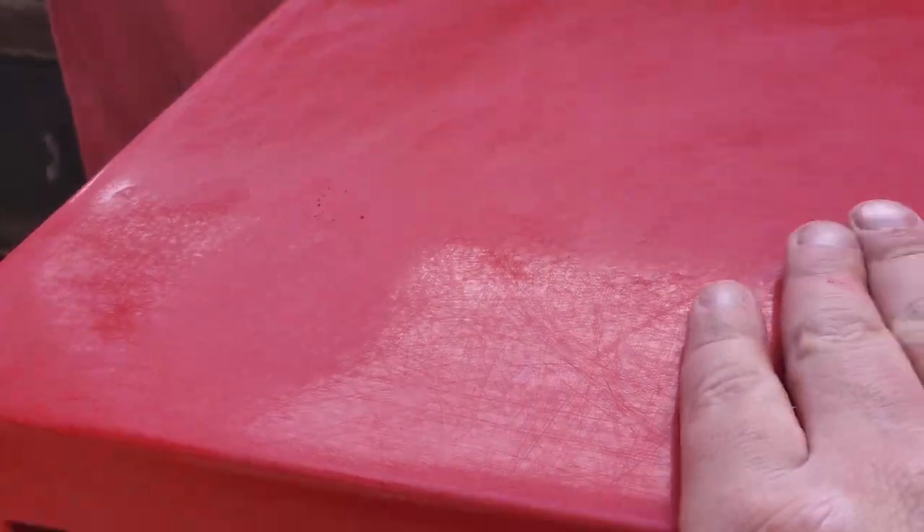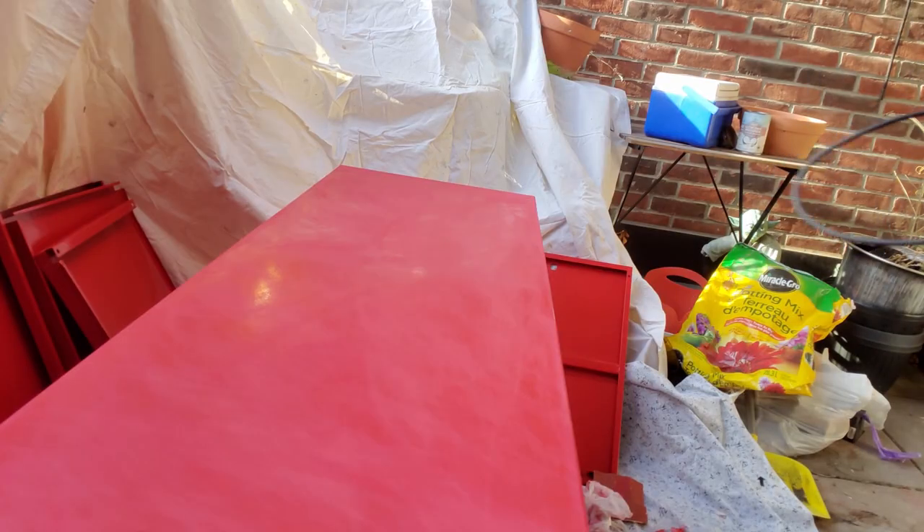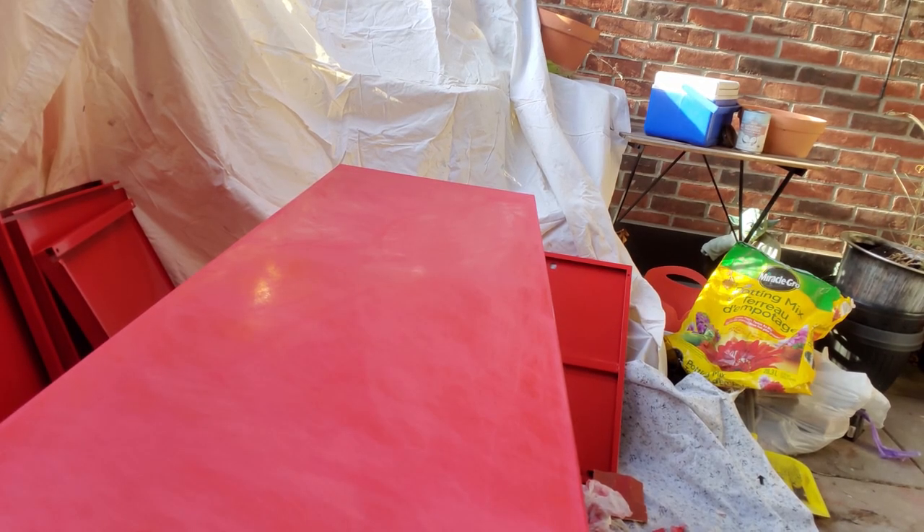You can see the big difference — everything here has only been done once, but this has been done twice with the 180 grit, so it's quite a bit smoother. I'm just gonna wipe everything down with a wet cloth to get all that dust up and then go over it all with the really fine sandpaper. Then we're gonna flip it and sand all the other pieces, get all the little nooks and crannies, and then sand the shelves and the doors.